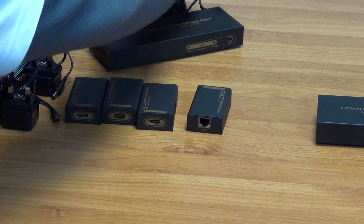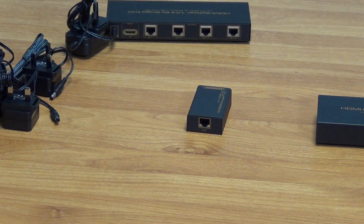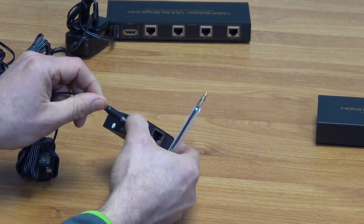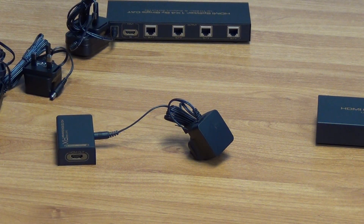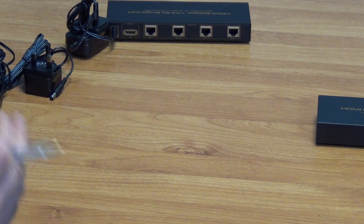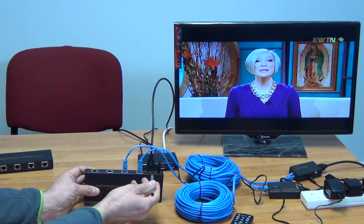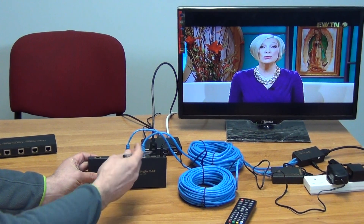We're envisaging a CAT5 cable coming out of the main unit. The same procedure applies to all the receiver units — the CAT5 cable runs directly in here. We have a power unit that connects into the side where it says 5 volts, and the HDMI output on the other side is what we connect directly to our TV. We can do this four times over. In our scenario here, we have a small HD set-top box with the signal running into the main unit, two outputs with two coils of CAT5 cable, two receiver units, and the power unit powering it.